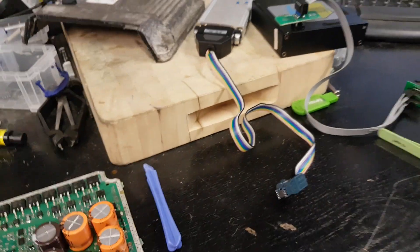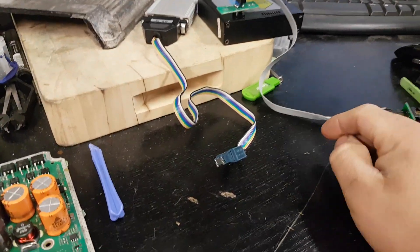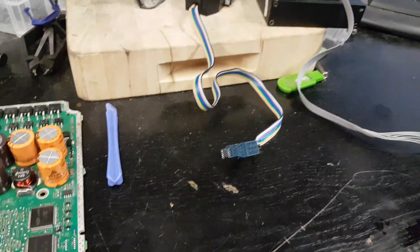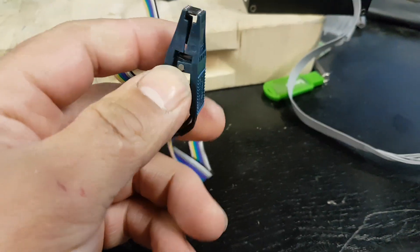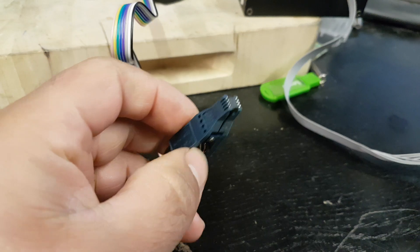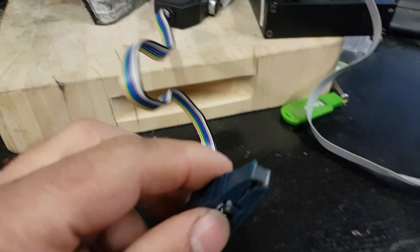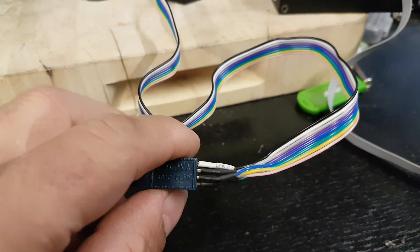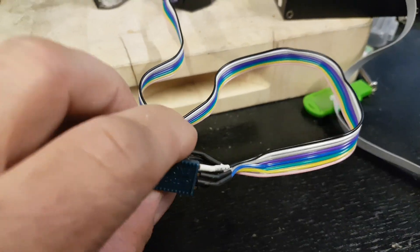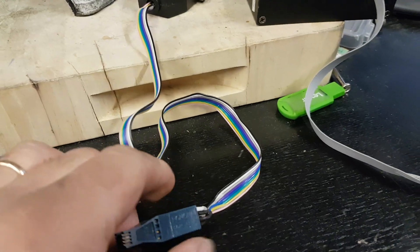For Carprog, I've never made a dedicated adapter for it, so I'm going to use the clip pliers. I don't really like to use these pliers but since I don't like reading in-circuit, I just put the chip upside down on them. Pin number one on my Carprog is marked with a white shrink tube — all the others are black except that one. I've already opened Carprog.